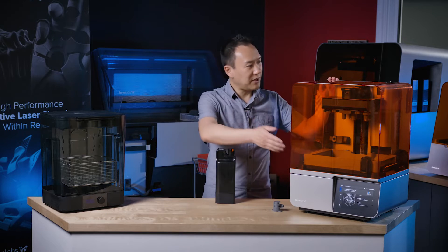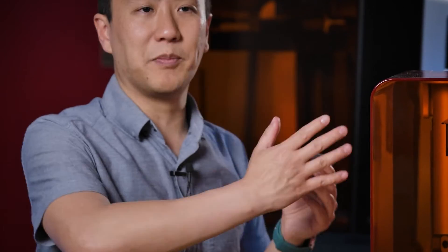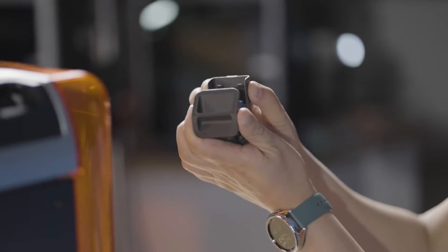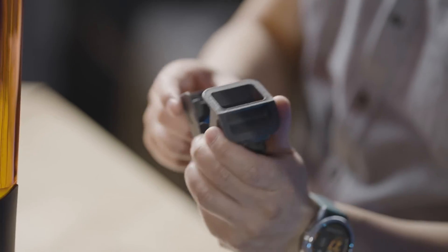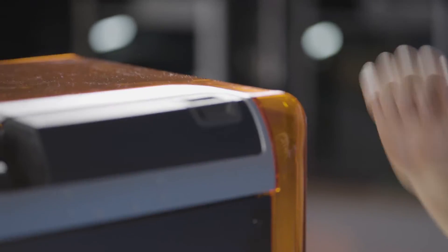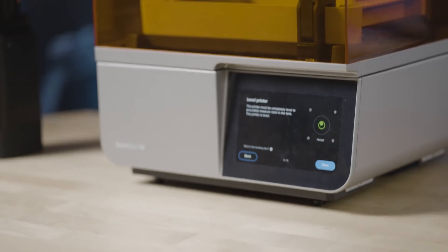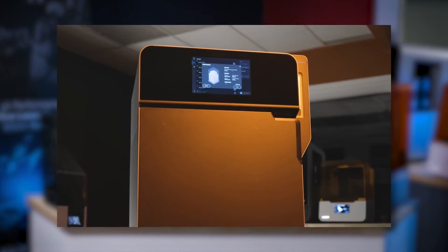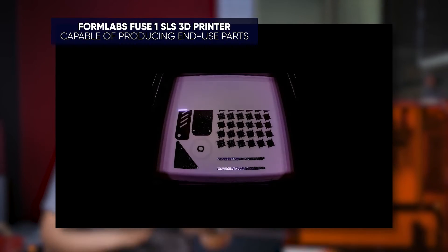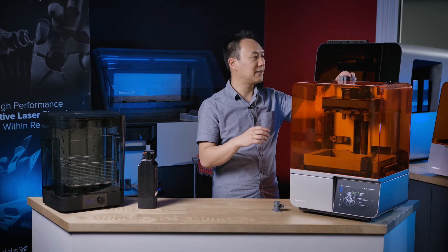In the back and front of the printer there's a small slot with tools for the Form4 that help you adjust the build plate. If you ever change the LPU unit and want to re-level the build plate, these are the tools you'll use — including shims for re-leveling the build platform. The build plate has three degrees of movement to compensate for misalignment; if you're more than three degrees off, that's when the shims come in. Interestingly, this part is actually printed on a Fuse SLS printer, a great example of production-quality parts. The tool slots back and stays with the printer.